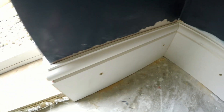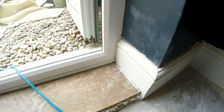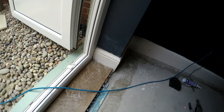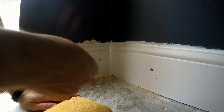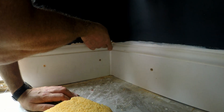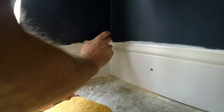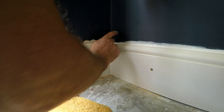It's imperative that these joints can move over time. Not so much the screw heads — I have done the screw heads in polyfiller, because the polyfiller grips to the screw heads and stays in place. But on the edging, and on the corners, and on the top of the skirting board, it's really important to do it with caulk, and to do it neatly.